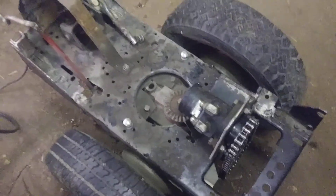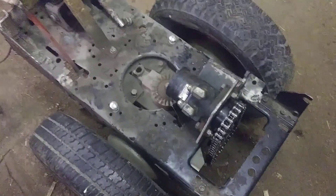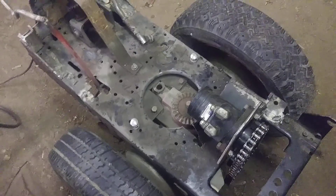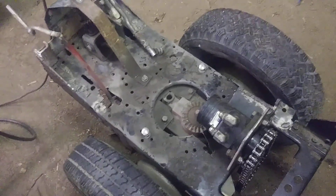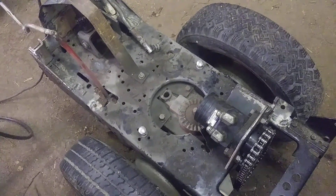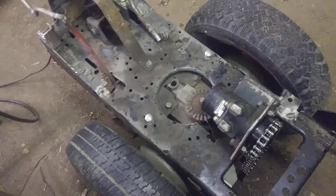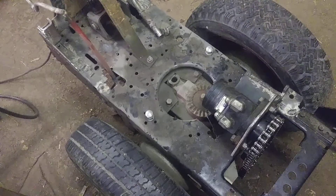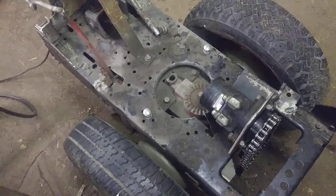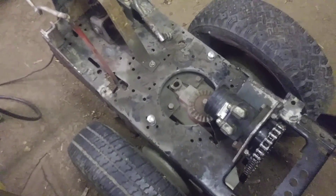I'm going to need to get a hydraulic hose crimper, and I'm going to go to smaller hose — probably quarter inch or three-eighths. On the Kubota backhoe they use three-eighths or quarter inch hose and it's good to 1500 PSI, which is more than I'll need. You can get high PSI in small hose, so that works. I need to pick the style of crimper that works best and is most affordable. I'd rather get my own tools, buy the hose and fittings, and make everything fit the way I want — it's DIY.